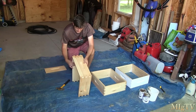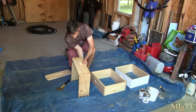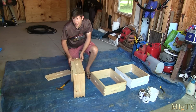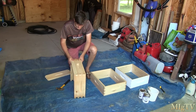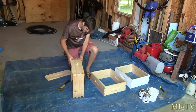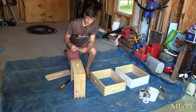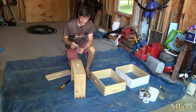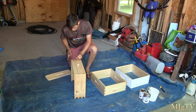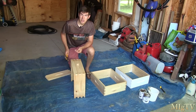and it is not rot resistant, so, whoops, I got an end there. So we are going to need to paint them, which is why you see some that are either varnished or painted. I like the classic white paint. Reason being is the white paint helps to reflect some of the heat. And there we go. And so if you want it to be a light color, if you do. A lot of people choose to varnish theirs because it's more natural. That's okay too. You can definitely do that. But the white pine with the outdoor white paint, easily the most cost effective.